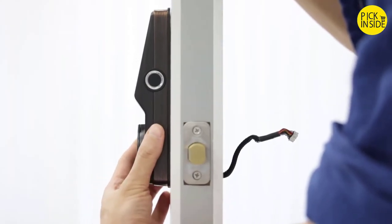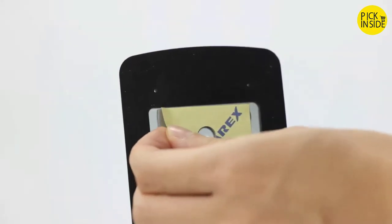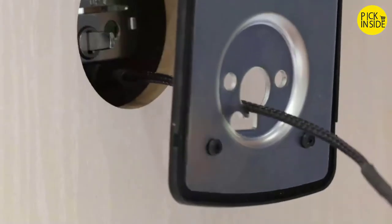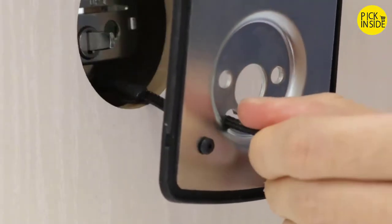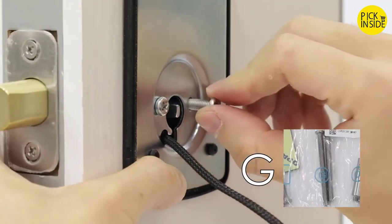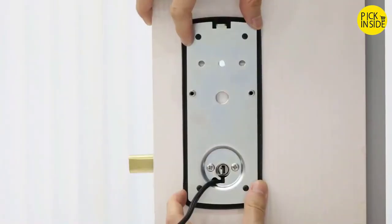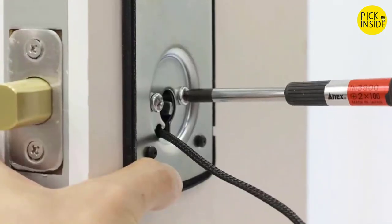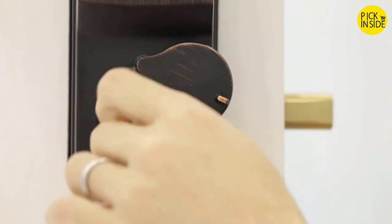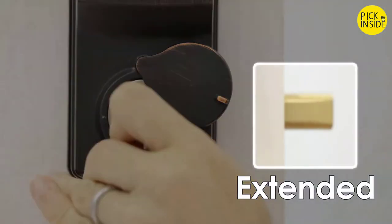If you don't want to drill a hole, double-sided adhesive tape is provided to help stabilize the lock — press flush to the exterior door surface. Install the interior assembly with adhesive strips. Align and secure the mounting plate, guide the connection cable through, and secure to the lower left notched hole. Tighten two screws by hand on the left and right of the blade, check alignment, and tighten with a screwdriver. Use the key to ensure the deadbolt locks and unlocks smoothly with no binding or rubbing. When finished, leave the deadbolt extended and remove the key.